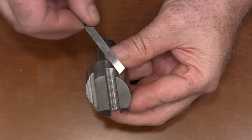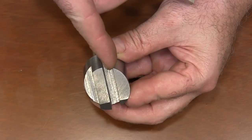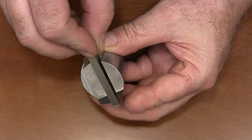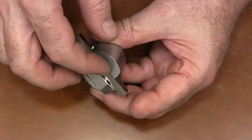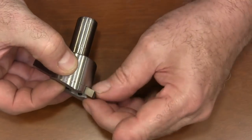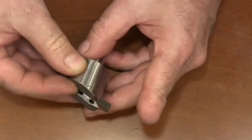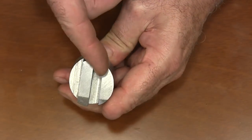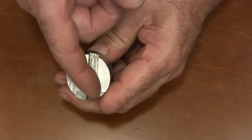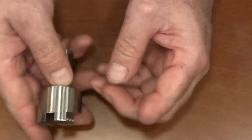so I cut it 3/8 deep and then a quarter wide, but the problem is then it was too deep. So when you put the quarter inch bit in there and looked at the angle, unless you stuck it way out here like this, it wasn't gonna clear the bottom of it. So anyway, I just went ahead, chucked it back in, put it back in the vise and milled it to the right size. And I'll just order some tool bits and it'll be fine.